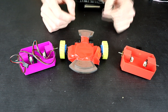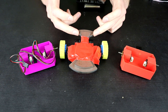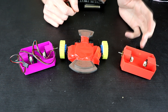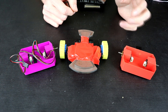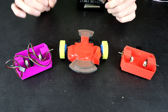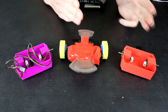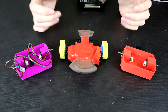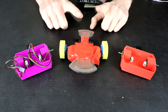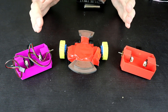Speed is the most important element in the motor choice discussion, and it mostly comes down to personal preference. 50-to-1 is what most people seem to run at the ARC league I fight at. 30-to-1 is for those who want to be a bit faster, and 75-to-1 I normally see with beginners running robots for the first time — though they do get outpaced by 50-to-1s fairly quickly. So it's a trade-off between controllability and not being beaten to the punch by your opponent.